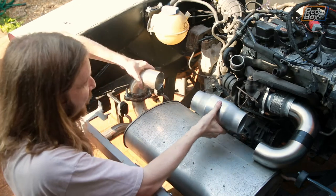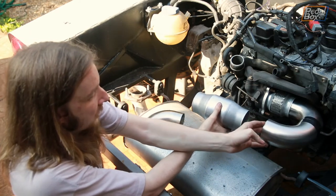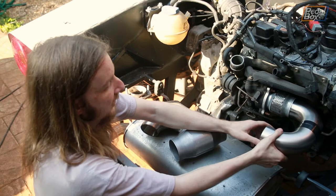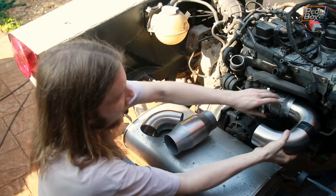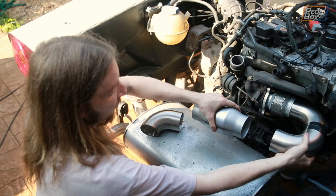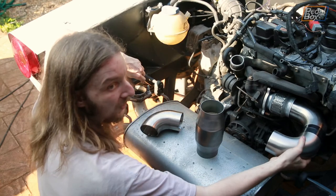And we're just going to put all of this in this sort of line. So I put the cat there and I just lift this up some. That's pretty much the arrangement we're going to be at. Now, we probably don't even need to cut off any of our angle here because there's enough flex, not in the flexi itself, but in the neck where it fits in. We've got a little bit of play in there. We can actually pivot that 180 forward a little bit, and it almost puts us exactly on the right alignment. So we're going to start tacking some of this stuff in place and just double check that we've got that one right.